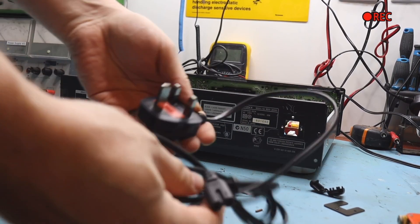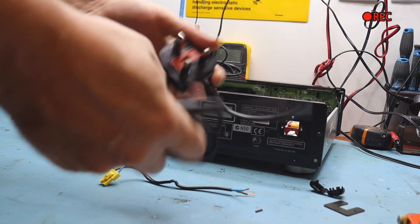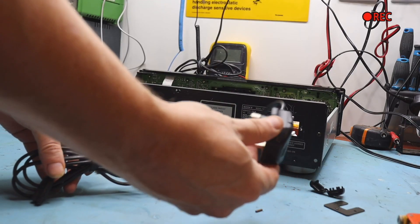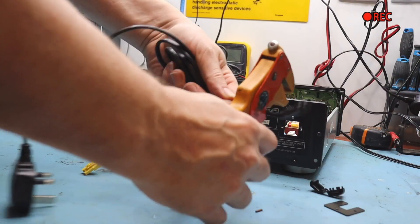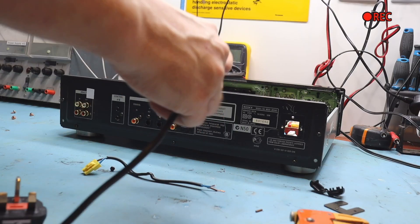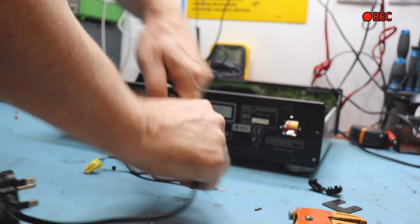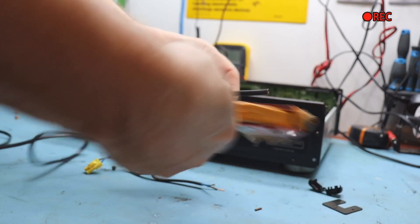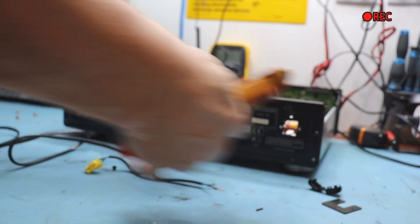For the donor cable, the easiest solution is just a similar type - a two-core cable. This one is rated at 5 amps for the fuse, which is more than adequate; you only need 3 amps for these machines. It's got a nice molded UK plug on one end, and the other end is just a captive figure-of-eight. We're going to chop that off, get rid of this little plastic tie someone's put on, then strip off the ends.